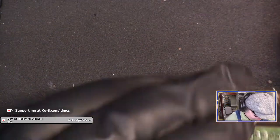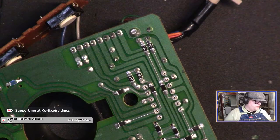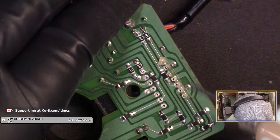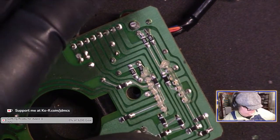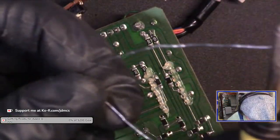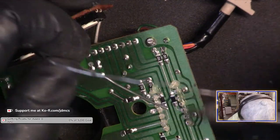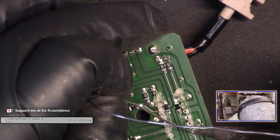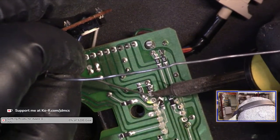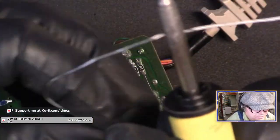All right, so I have the pins lined up. Yes, I could modify a 16 pin one, but I would know that I did that and it would probably annoy me somewhat. Because I would inevitably fight it trying to cut it nice and pretty and whatnot. But the thing is, I don't think there's enough space for a socket in the mouse because the chip is right under the board with the buttons. So, yeah, there'd be a clearance issue.